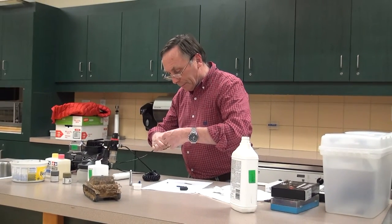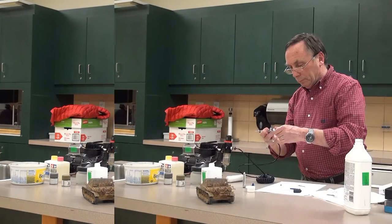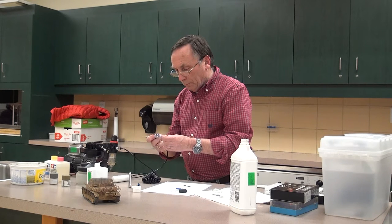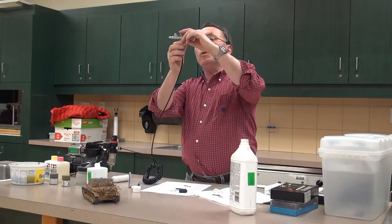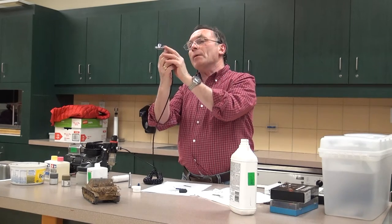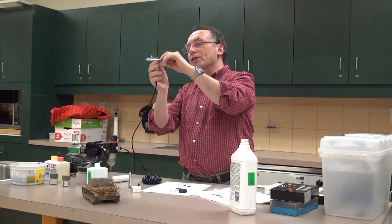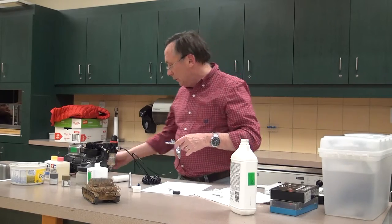Another thing is, reassemble it. Now, where it goes down here, you push down, there's a little valve here, it's spring-loaded. Sometimes that might stick. Just disassemble it, put some WD-40 or light machine oil there, and you get a nice action. If you want me to, I can show you how to strip that apart.